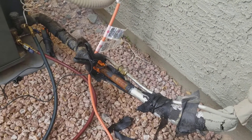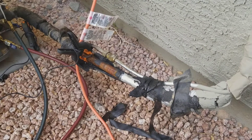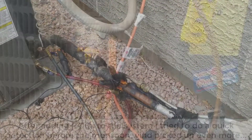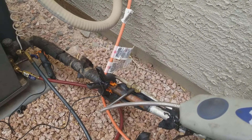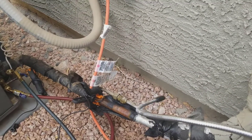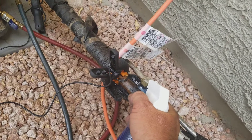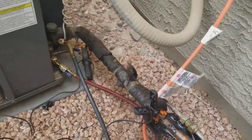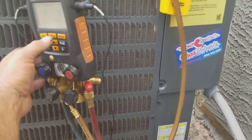I'd be tempted to just cut that out and put a 7/8 flare fitting right there. But for right now, we're just going to get some refrigerant in here — it's a pretty slow leak so it will cool for them. It's probably leaking from this 3/8 flare fitting. That line's nice and cool coming back. Surprise, it's so cool at the house at 95. But again, this is Chainsaw Charlie.